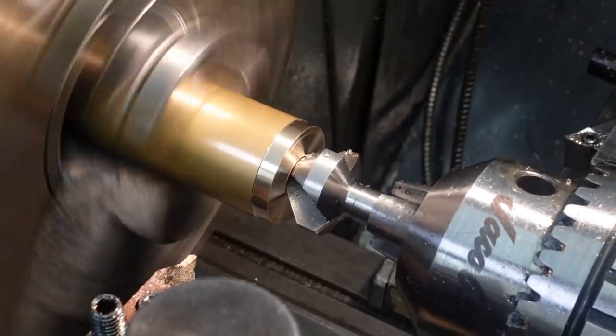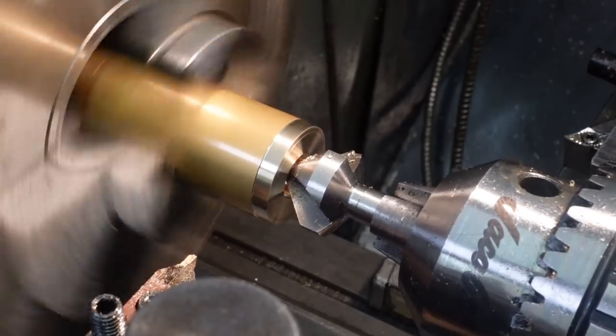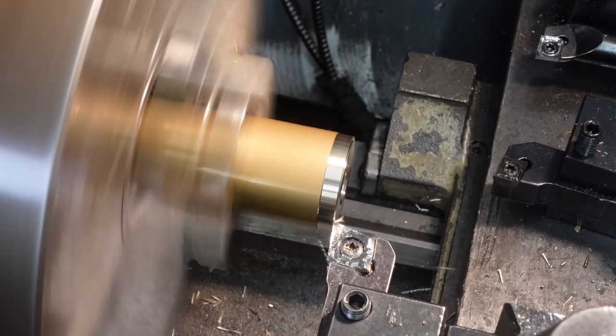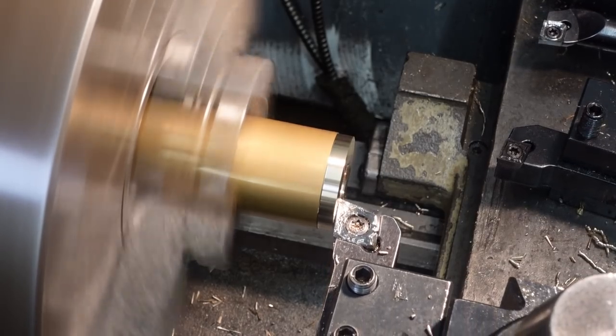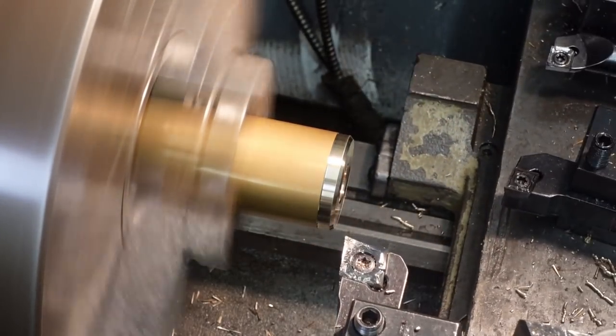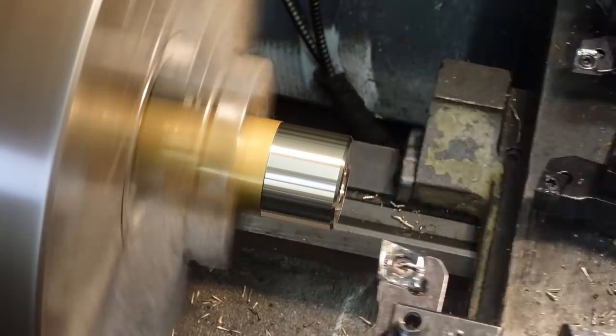The outside diameter's turned to 29.62mm because it's a nice sounding number with no occult significance and isn't seen as unlucky by any of the civilizations on the planet according to Wikipedia. The outer face will be the finished surface, which is in contact with the lock nuts, so I'm giving it a generous countersink and outside chamfer.